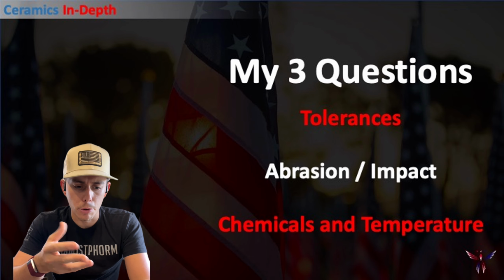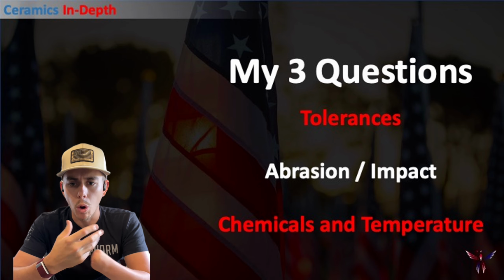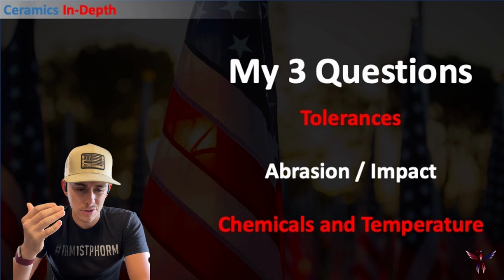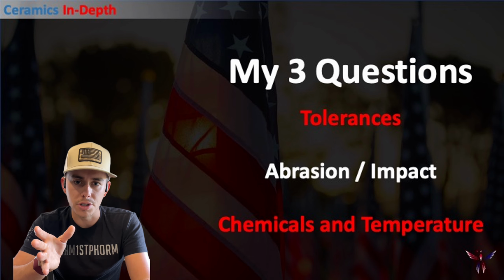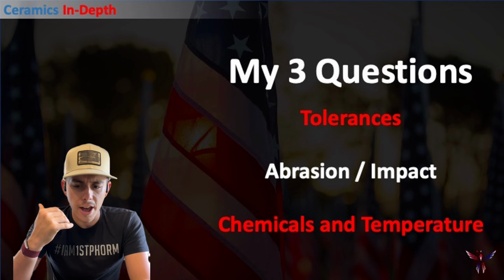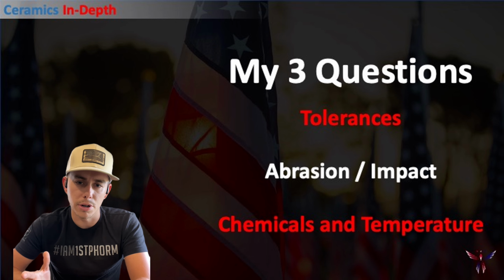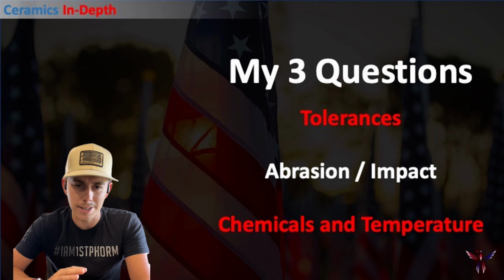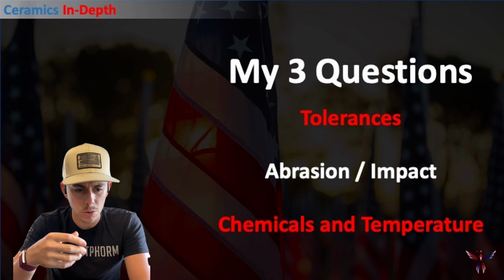Now, when we're going through, if a client calls and says, hey, I have an application, what would you recommend? These are typically my first three questions. There's a lot of offshoots to this, but these are kind of the three main categories. The first one being tolerances. The second being, are we dealing predominantly with abrasion or impact? And lastly, what are the chemicals that are in the system, and what temperatures are we dealing with?